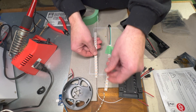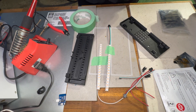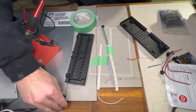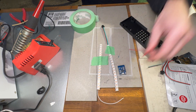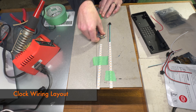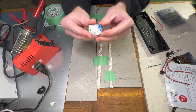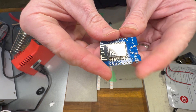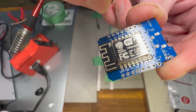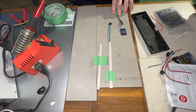We're going to have these two strips and we'll have to solder them together. The current goes this way on one strip and then comes back in the other direction — you might want some extra wires for that. We'll have our soldering iron and resistors ready. We're going to power the Wemos with a USB-A cable, which connects into the box when done and also into the computer when we first flash the firmware. We're going to connect the pins to the LED strip: 5 volt, ground, and D2 as the data line.